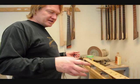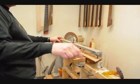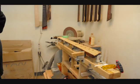This is a jig that holds the neck. We'll adjust the amount of relief to less than 1/1000ths along the entire length. Matter of fact, we sand it to under a quarter of 1/1000ths of variance along the entire length. Wow.